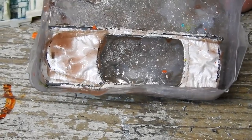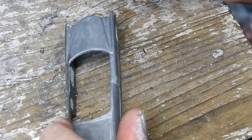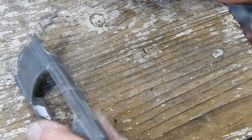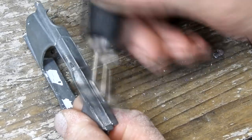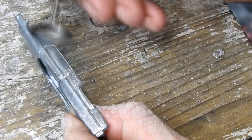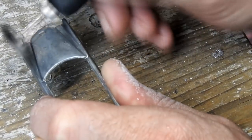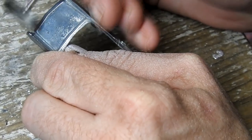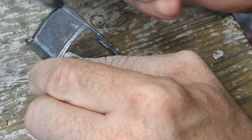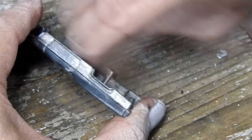Some poly stripper is used to strip the paint from the casting. Next I give it a tidy up with a wire brush on my rotary tool, removing any oxidation and any remaining paint. Stubborn paint patches are dealt with using some steel wool.